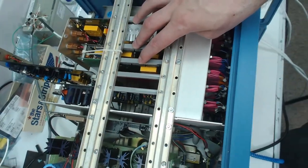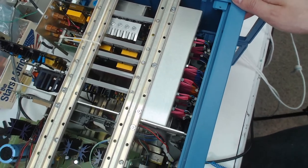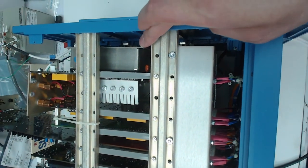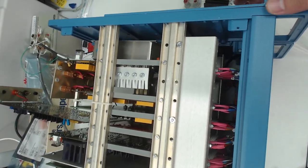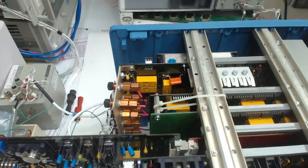Then there are two relay boards which are switching different taps on the transformers inside of the main current comparator. And then there is a detector board, which is this guy, and it actually has that metal can. That is the EM-A10 custom amplifier. So it's not a standard A10, but one specifically optimized for the bridge use. Then we have big huge copper terminals over there. And then we have the main transformer with all the DCC stuff happening inside, like in the shielded can over there.